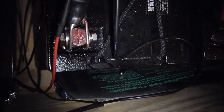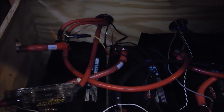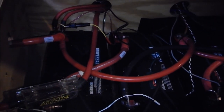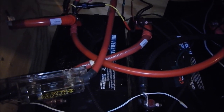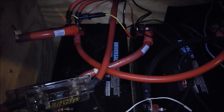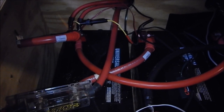I'm making this video right now to show you how good it works. I got all my fuses, everything protected. These are six AGM batteries at 90 amp hours each, wired in series-parallel, giving me a total of 270 amp hours. They're universal batteries — not the high-dollar AGMs — but hey, they're getting the job done. These are renewable energy batteries I got from the Alt-E Store. They're doing a great job and they're five years old.